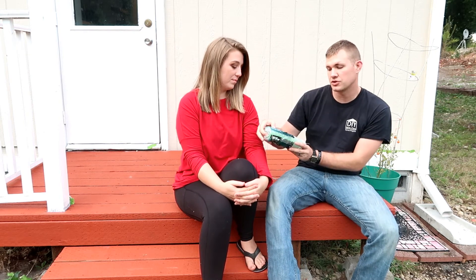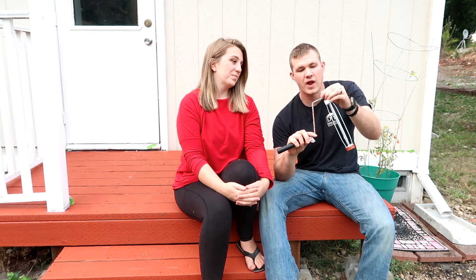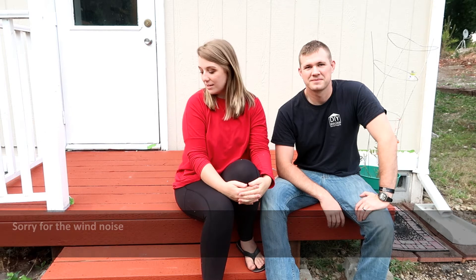We've finished up now — two total coats done using this extra textured Deckover roller cover. Even looking at the roller afterwards, it is very thickly coated and caked on; it would take a lot of work to scrape off, though it is still reusable. It's very built up and durable, and I think it's going to be a great product for keeping the wood preserved long-term. I did a lot of the prep work and application, since Chris works a full-time job. For the first coat, we went in with a paintbrush to fill in all the cracks and gaps and get a base coat on, then the second coat — two coats as recommended — we did with the textured roller.